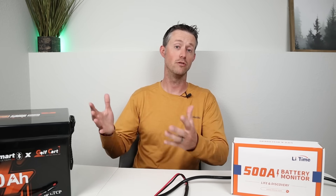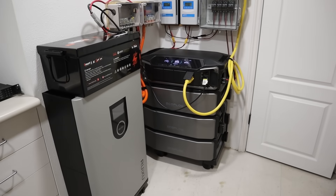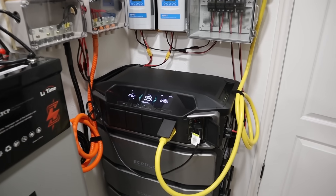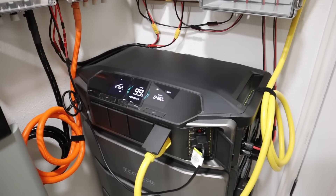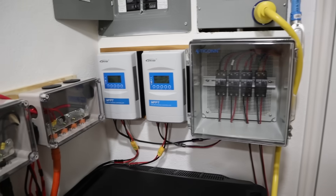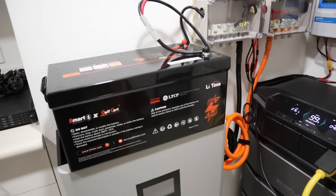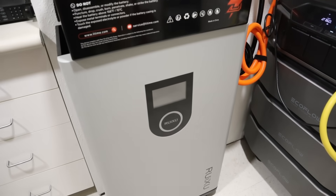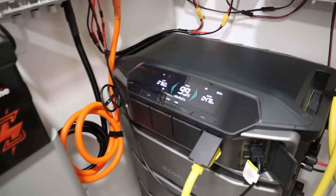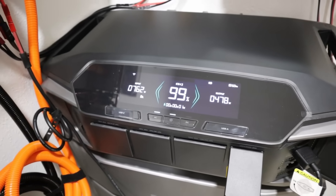I'm super familiar with this process of using 48 volt batteries to extend the runtime on my power stations — I do it every single day. I use the EcoFlow Delta Pro Ultra as my daily driver and I have a pretty large battery that I also charge with separate solar panels. I have four solar arrays: two going to the Ultra and two going to that battery bank. I've also connected this battery in parallel with that bank and I'm able to take that extra power and charge up the Ultra when needed, so on cloudy days I can connect those batteries into the Ultra and get much longer run times.